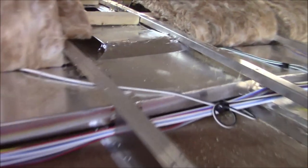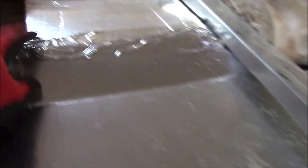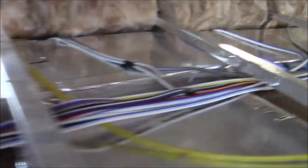Now what we're doing is pulling all the insulation back and checking the trunk lines — that's what we're looking for. Right there, see? You can see that big gap right there. So we're going to re-tape that, get that down, and we'll check this too. We want to make sure all that's all set.